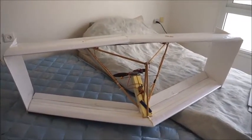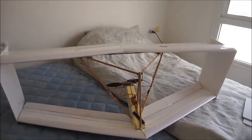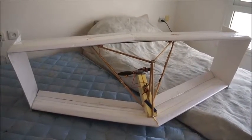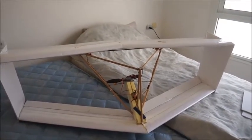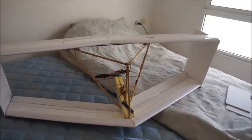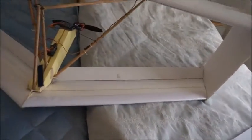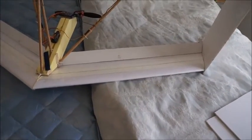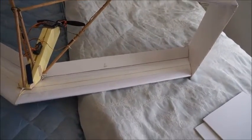You can see the flight video — the initial one has just the takeoff and landing and a short segment of it passing fairly far away, so it's hard to see, but the takeoff and landing are visible. I hope to get my neighbor to film a better video of this thing flying. My hot-wiring skills are still not perfect but getting better. I use these light styrofoams, cover them with tape, and use carbon fiber spars — the wings themselves are quite rigid and good.